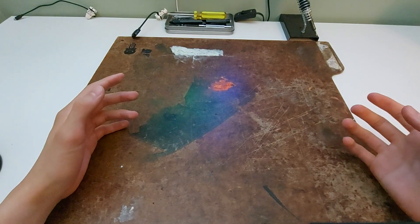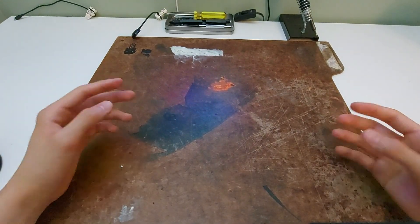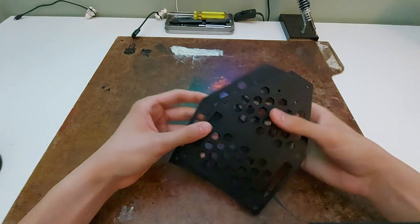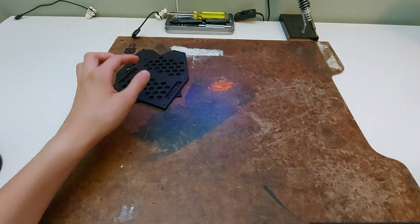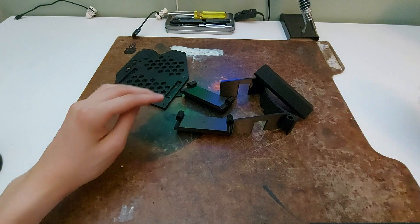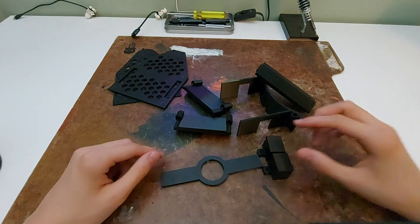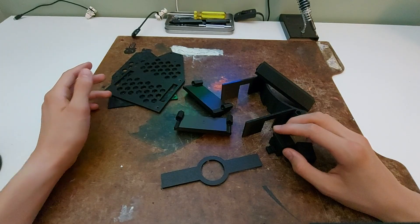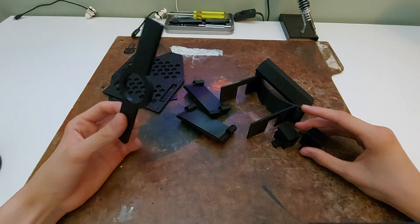This robot is just a prototype and it's not going to be seeing any battles anytime soon. So a lot of it is actually 3D printed out of PLA, which is a brittle and relatively weak material — but it prints super nicely and it's pretty cheap. I printed a lot of parts with it, including my top and bottom plates, all my armor, my motor holders, and this little weapon bar. These would all be replaced with stronger materials in the future for an actual battle. Plates would probably be carbon fiber, armor would probably be ABS, motor holders would be either PETG or ABS, and the weapon bar would most definitely be metal.